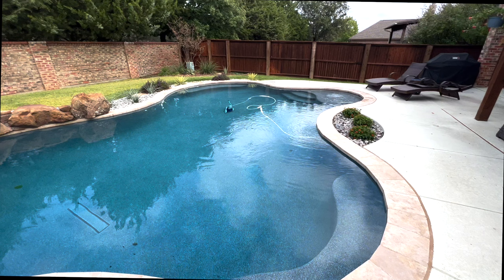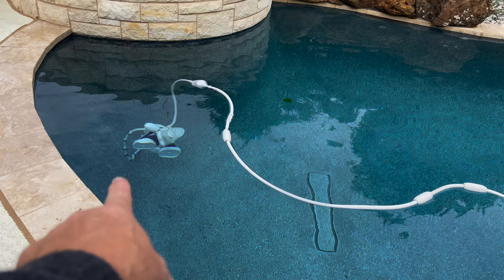This is the method used for the Polaris 280 and 380 cleaners — other cleaners like the Quattro are different. The first thing you do is cut the hose for the depth of the pool. The length from the cleaner head to the first swivel above the backup valve should equal the depth of the pool. This section is called the leader hose — it is the only part of the hose that should go underwater; the rest of the hose floats on top of the water.